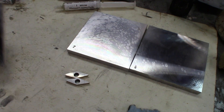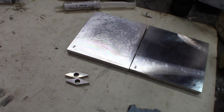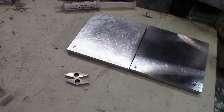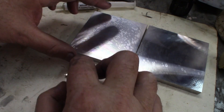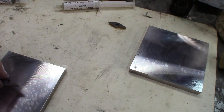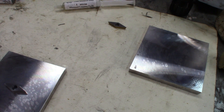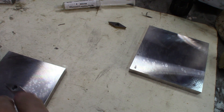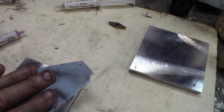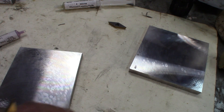We carefully put aside the 20-micron grit in a clean place so it doesn't get contaminated, because we've got other inserts to do. This is the rag for the 20 microns — this has to be put aside. Cleaning up the table, making sure everything stays clean. Now let's go for the 7-micron grit. The witness insert always stays aside. The one that was done with 20-micron grit goes on this. Let's go with a clean rag again. Make sure nothing's been on that little 7-micron plate.